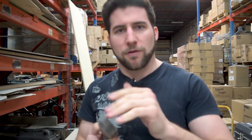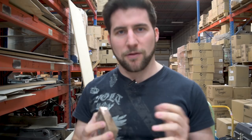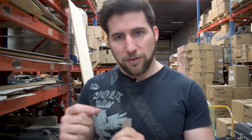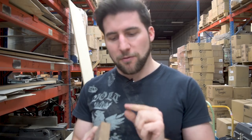We want a nice thin area down the middle that we can rest on the fretboard. It's wood on wood so it won't do any damage, but we'll tape the fretboard anyway. You'll be able to angle it as you go. I like having this longer surface so I can do longer strokes, get something easier to grip, and have a longer piece of sandpaper so it doesn't wear out as easy. Dan's method uses something thinner with a small piece of sandpaper - very easy to control and convenient to move along when it wears out. Not quite what I'm going for.